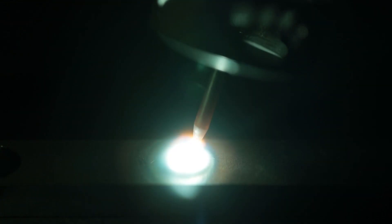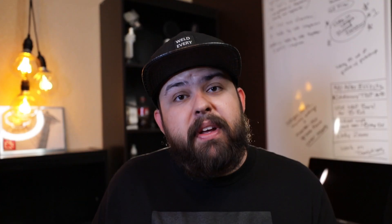On, off, on, off — all of that time that your arc would have been sitting on that piece of metal at full amperage as you're dabbing along, that off time really eliminates a lot of heat. Now here's a T-joint and we're fuse welding it. Any fuse welding needs really tight fit-ups — if you're going to fuse weld anything and there are any gaps, you're going to blow it out. So you need to put a lot of tacks on anything you're going to fuse, press everything down, and make sure it's a nice tight fit-up.